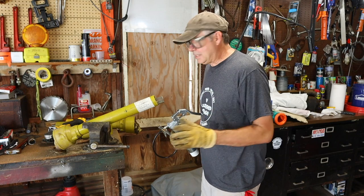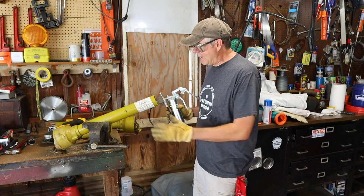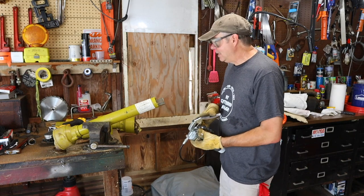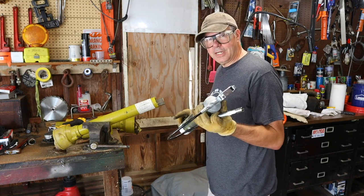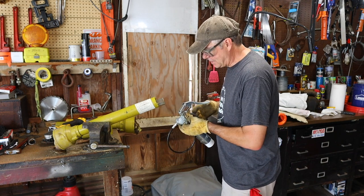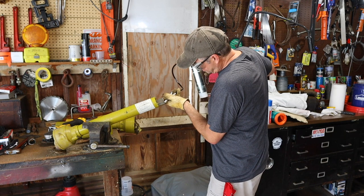Now if you wonder which one is the outer shaft and which one is the inner shaft, well the outer shaft is the one with a label on it. So that's easy to remember if you have a label. I'm going to take my Lube-Shuttle grease gun and I'm going to grease the inside of this, and I'll slide the other one back and forth a few times just to get some grease in there. So I'm just going to go around the edge here